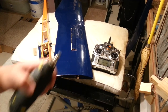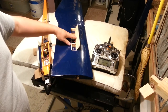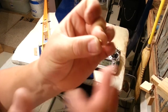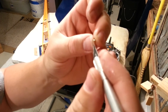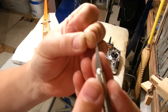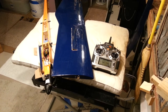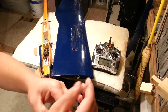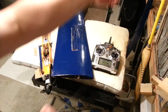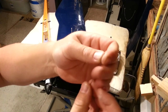So I'm just going to use my Dremel-like tool to cut off a short chunk that's about 3/8 of an inch wide, or maybe a little bit less. Okay, so I got my super dinky little brass piece here. I got a nasty edge on the end. So I've learned, just use your X-Acto knife to deburr the hole. And before you dig into it too much, get a piece of your stock that's supposed to go through it, because once this thing's glued or taped in there, it's going to be a pain in the butt to test. And it looks like this end has been marred up a little bit, so I actually just go to this end. Just make sure it's going to slip in there. And sure enough, it does.